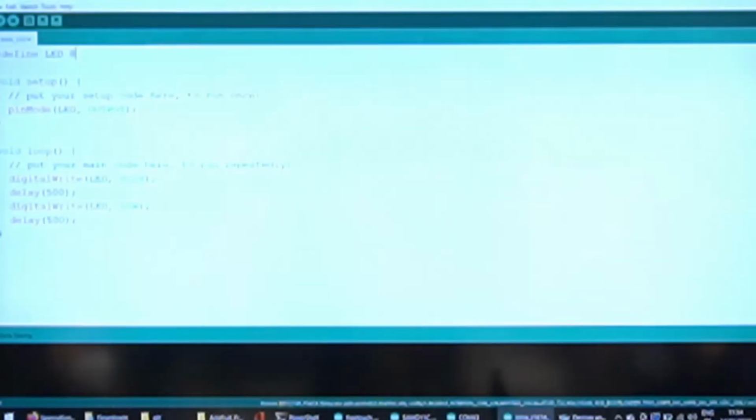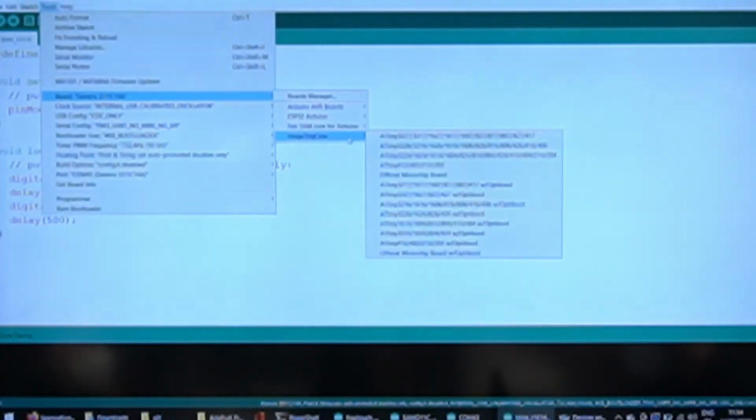So, Blink program using Spence's Mega Tiny core. It's a 1614, I'm being told. And let's look at the options. Yeah, it's perfect. No need to change anything. And look, the serial port this time. It's my programmer serial port, because it's the only thing connected to my computer, yeah? But if I'm going to select this.